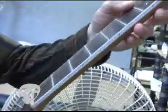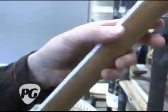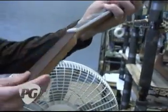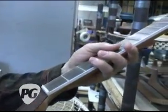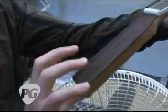Here's a neck that has been glued together with the fingerboard, which is finished, and this will be taped off before it enters the lacquering area, because, as I said, this is pretty much complete. The barrel of the neck still needs to be sanded and shaped and measured with the quality gauge. Same goes for the headstock and the head plate, and then this will be prepared to go into finishing. And just before finishing, we'll see where the tuning machine holes get bored in.